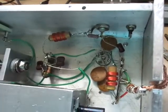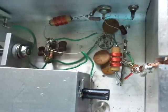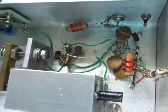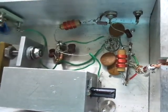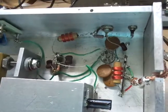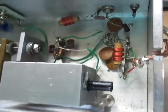The circuit - the coil pits - is basically ripped off a Heathkit VF-1 without the big tank coil. I just used a plate choke on there. It's fully regulated - the plate and grid number 2. I just used a dropping resistor on grid 2, and it's working very well. I suggest if you build your own VFO that you fully regulate your power rather than just grid 2 on the Heathkit design.